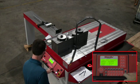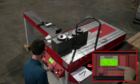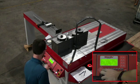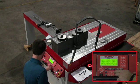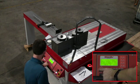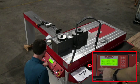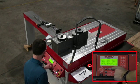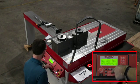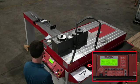Now we're going to go ahead and make some corrections. I'm stopping the program — we're on step four and going to the correction side because the angle bends on the piece are a little tight. I'm going to go ahead and enter minus three degrees, then put zero back in there because step four is not where we want to make the correction. We want to make our way to step two and three, which are a little bit tight. The width on the part is very close, it's just a little too tall and the legs come a little too far in. On steps two and three we're going to put a minus three degree correction, which will spread the bottom legs out and bring the top down just enough — we're about a quarter of an inch too tall. You can go to step two very easily, select your step, and make the corrections you need, then bend your next part.